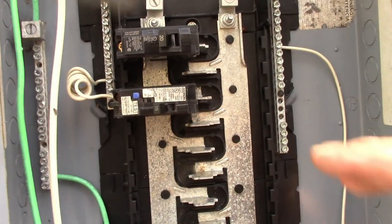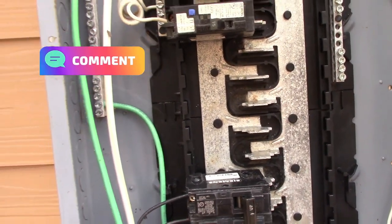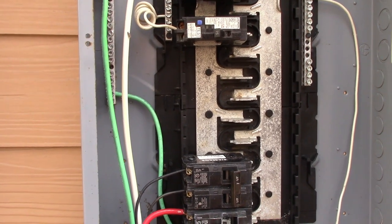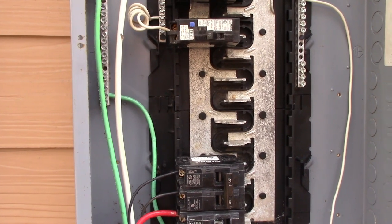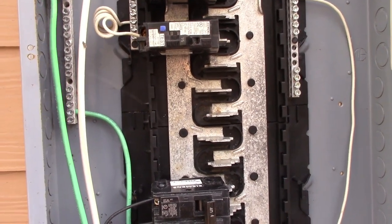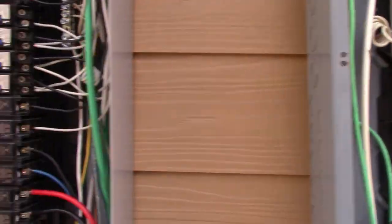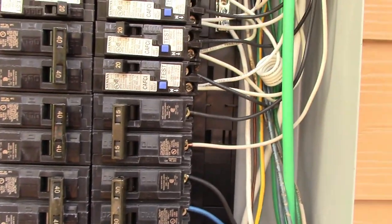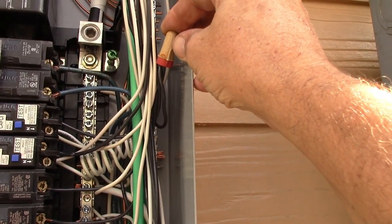Here in the transfer panel I've set up both a regular breaker and an arc fault breaker so I can show how both work. Arc fault breakers — even in years of co-training with my electricians — very few actually knew what an arc fault breaker does. An arc fault breaker senses microscopic arcing. What causes microscopic arcing? If connections become loose, they create microscopic arcing, which can ignite the oxygen around it and cause the device to burn up or even start a fire.